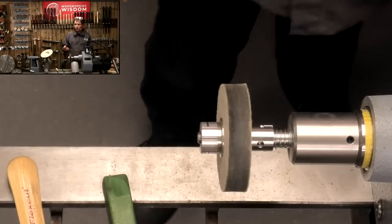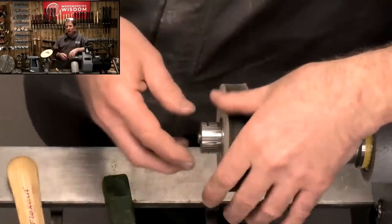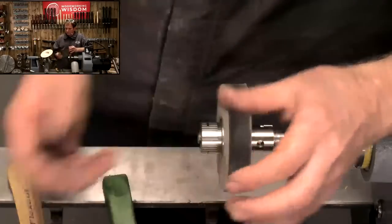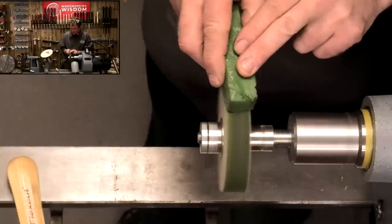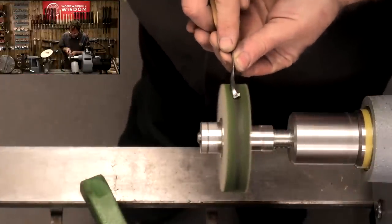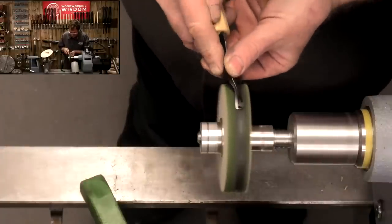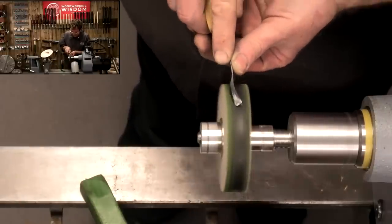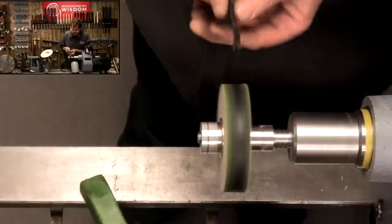The whole idea behind what you're looking at now with the carving tools, we used to sell a Creusen grinder 15, 20 years ago that ran in reverse. Well, we used this in reverse, put some soap on. So this is a felt wheel. We can do the edge, and I'm coming away from the cutting edge. So I gently draw my hand up, bring it round. Okay. Wonder if we're getting sharper. Feels a bit better.